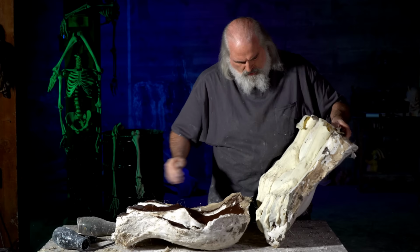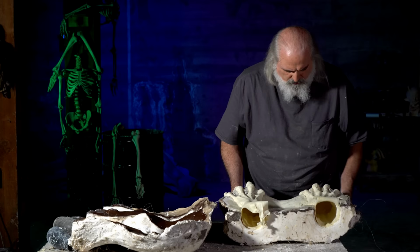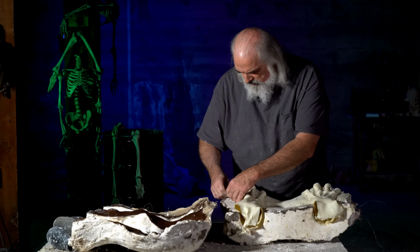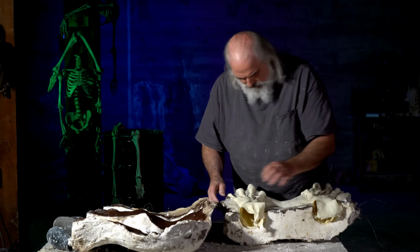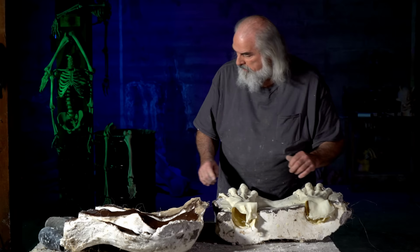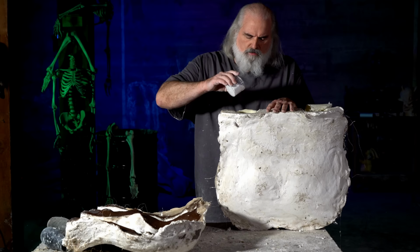Look at those monsters. So, let me let you get a good shot at them. So that's what it looks like: your sculpture now in hollow rubber. And I would just pull them out gently, because even though they may be cured, they are moist, at least that finger. So I'm going to put a little more latex in it and hopefully save the day. Now, if you do get little tears, you can certainly patch them up with talc.